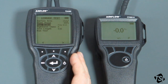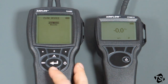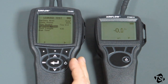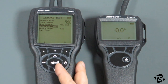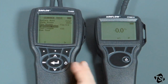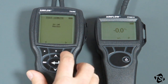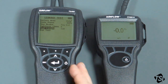Flow device: there are two flow devices for the Panda — the built-in flow grid, which is what we should be using, and also the low flow nozzle, which is named 'nozzle' on the menu. If you wanted to use the nozzle you'd just select it, but we want the flow grid in this case. Then we have the tightness class, which is specified by the standard. There are four tightness classes: A to D. A to C are the ones normally used; D is for special laboratory purposes. Class A is the easiest and least tight, which we'll select today. Save it. Now we need to set up the test length — the standard specifies that the test length should be at least five minutes, so we're going to change this to five minutes. Save that. We now have all the parameters required for the test set up and ready to go.